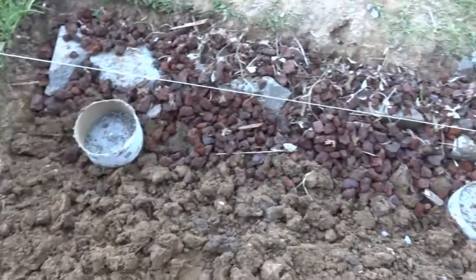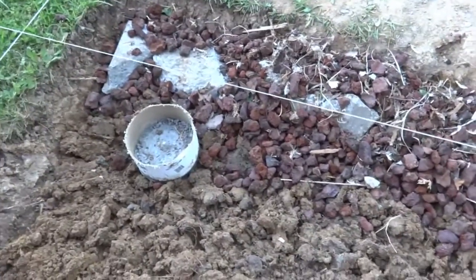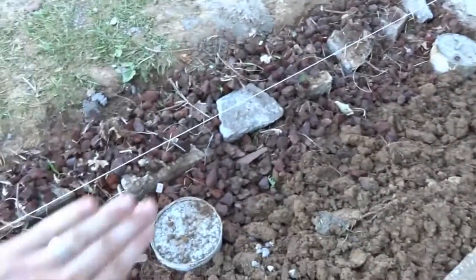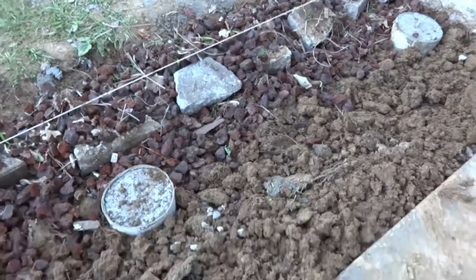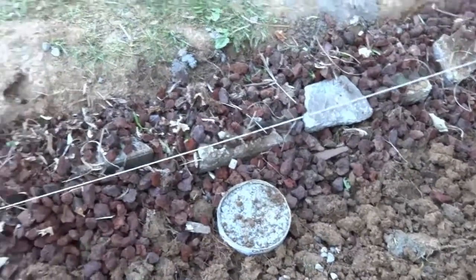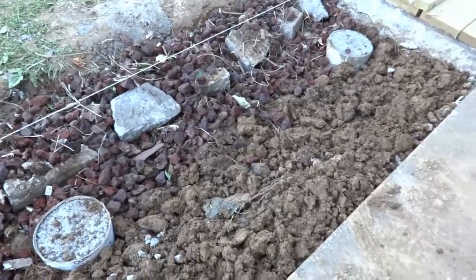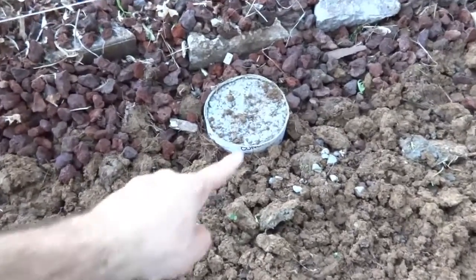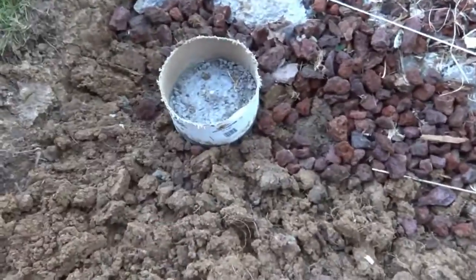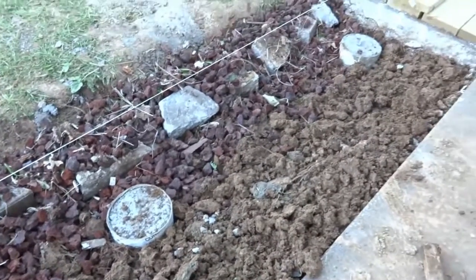So there we go — it's not pretty, but it'll work. I got the dirt sloped down to the front edge, and I put in all that broken concrete and lava rock that I took from the landscaping to act as both a retaining wall for the deeper side and as really fast drainage, so water will roll over the dirt and empty into there. Now all I've got to do is let the concrete footings dry another day or two, tear off some of the cardboard, put my landscaping felt on here to cover it all up, and then I can actually start building the deck.